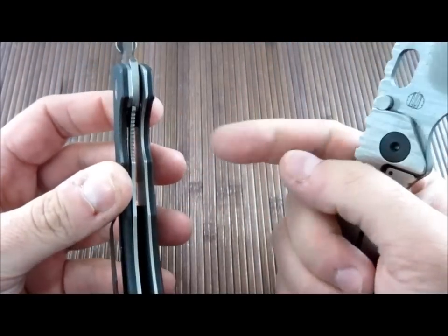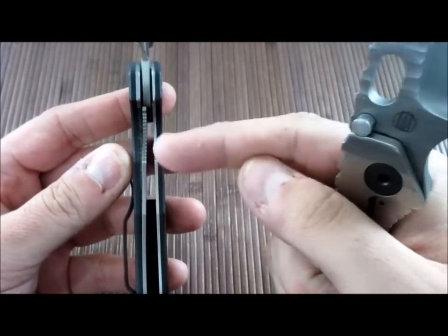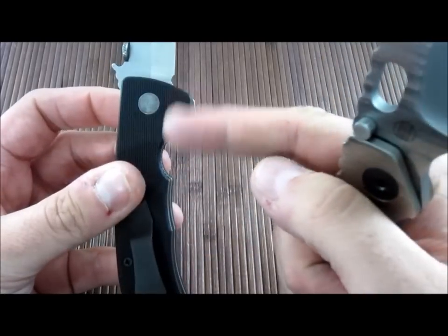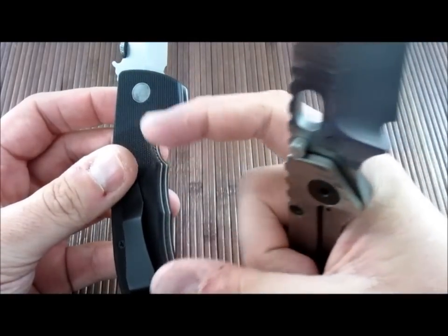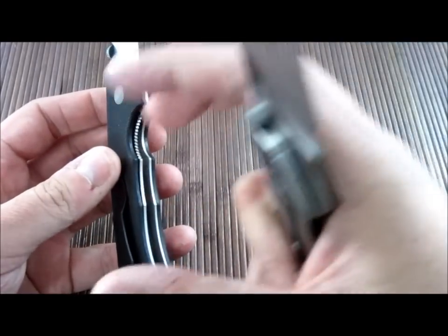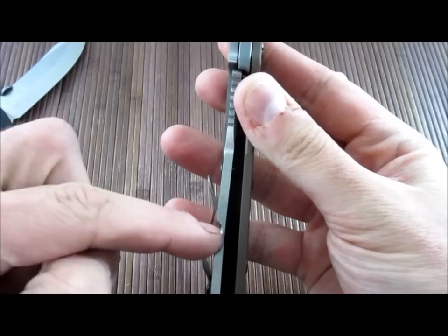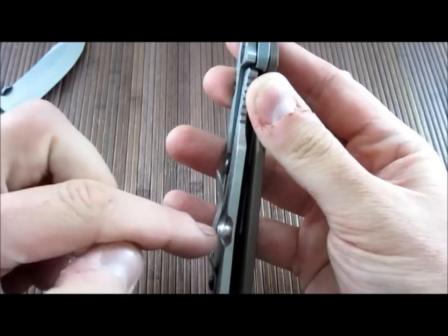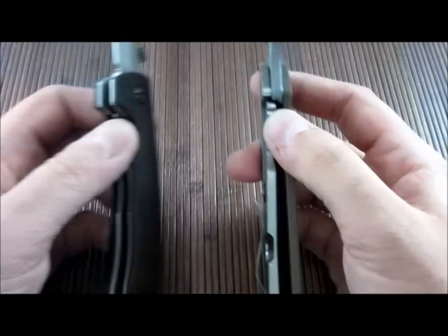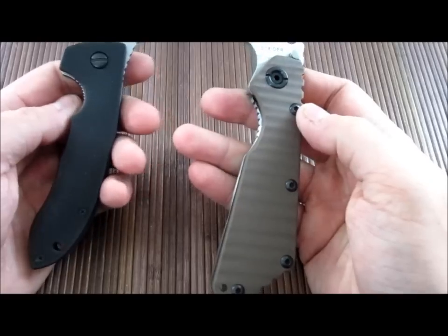Here's why I changed my view. If a liner lock is in an instance where it cannot move and all the force is being applied to it, it's going to bend and hit the scale, which redistributes some of that force throughout the frame — all that force gets absorbed by the whole structure. With a frame lock, all that force funnels down to one point and that's it. It doesn't have anywhere else to go and it is going to break out right there. But that being said, there's no way to prove this — no way, there are too many variables.